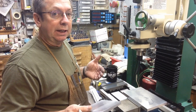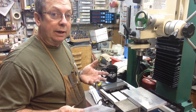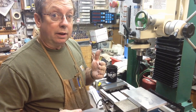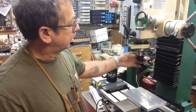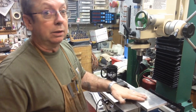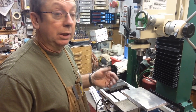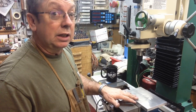Now it's starting to show some things that I'm going to have to address. I could have torn the table off, deburred everything, and run an indicator across it — we've shown that before. I haven't traversed the table back and forth to find out how in-tram the mill head was going this way, and that's one of the things showing itself right now. I fly cut these both with a Tormach Superfly — it's the one still here in the mill — and the insert is starting to get a little dull. I intended to change it before this cut but I got around this morning and just ran the fly cutter across to move along.